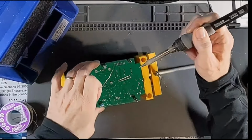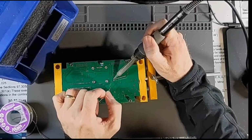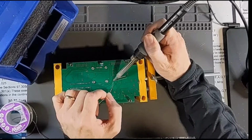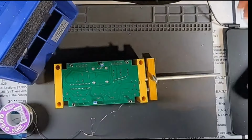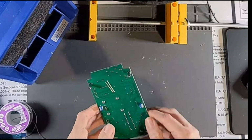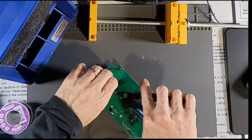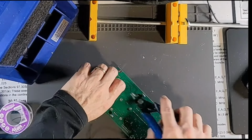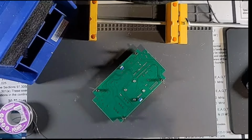One thing that's really, really important if you're going to tackle something like this is you want to have a really good soldering iron. And I'm using a Hakko FX888D. It's a great iron that's really inexpensive. It's like 80 bucks, 90 bucks, I think. But Weller makes some great ones. Xytronic makes some great ones. The key thing is you want it to be regulated. For years, all I had was kind of the standard, you know, Radio Shack, just a pencil iron that had one setting.